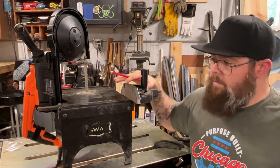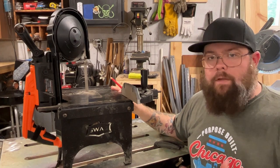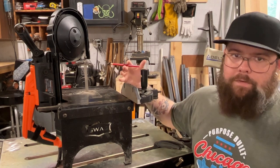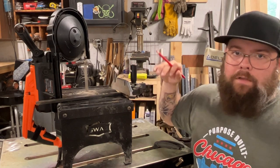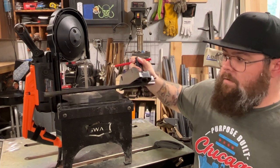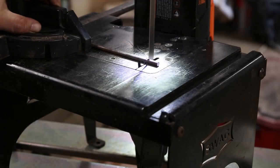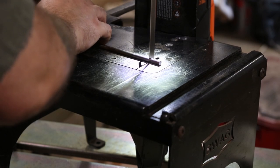I really feel like to get the most value out of your portable band saw you need some sort of stand for it. There are a lot of great DIY options as well as commercially available options. I chose the Swag table because it's got some nice features and is still portable — since it's on a stand with legs I can take it outside and move it around the shop. I'm becoming a bigger fan of having tools that can move to the work versus moving the work to the tools. One feature that's difficult to replicate on a DIY option is that this table has two miter slots, allowing you to use a miter gauge for nice straight 90-degree cuts as well as 45s and any angle in between.